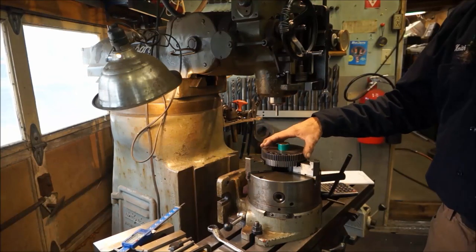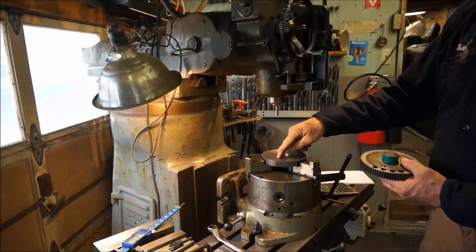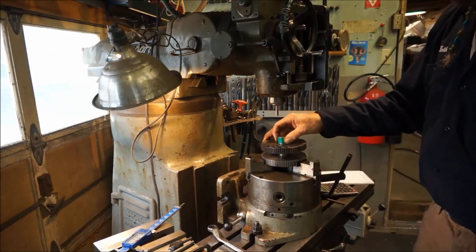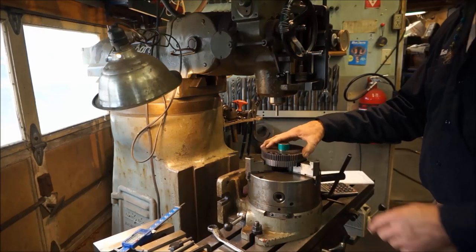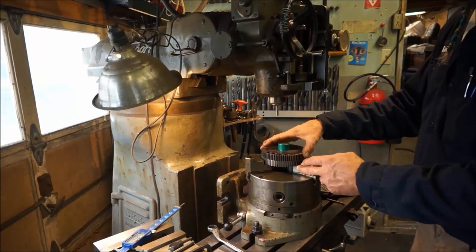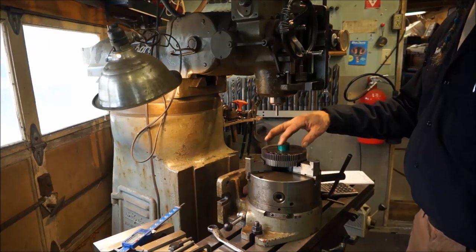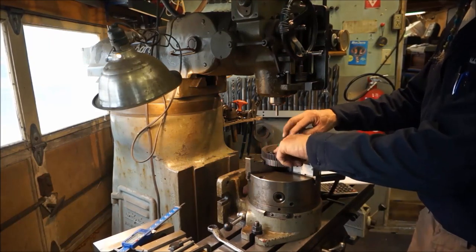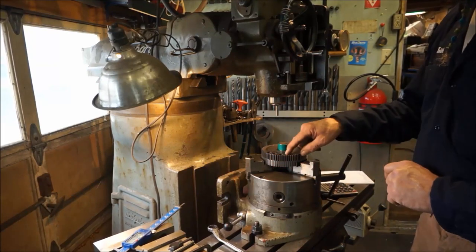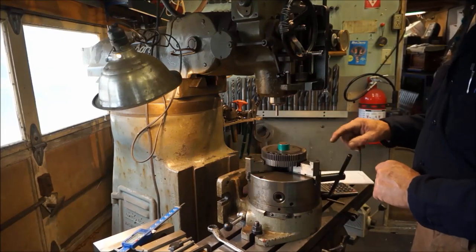Now we're going to put that 5/16 reamed hole right through here. Then we'll be able to drop that pin in there, and for the rest of this duration, this will hold the center for clocking it, and this right here will be holding it from the play. So every other location on here, between these two added holes and these four lightening holes for the balance, everything will be exactly the same as the sample.